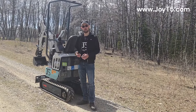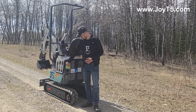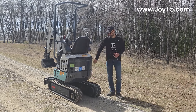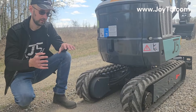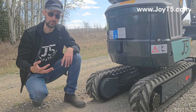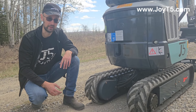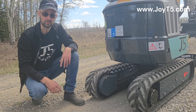Unlike many 1.2-ton machines, this one actually has a cast iron counterweight. All of these parts are cast iron, which will add extra stability during digging. Here we have our double speed motors. The benefit, in addition to the extra speed — we will show you later how it drives and it's very noticeable when you're in the high gear — is that it also protects the hoses with covers for your motors.